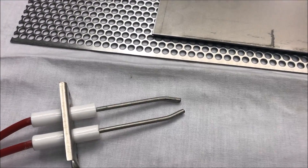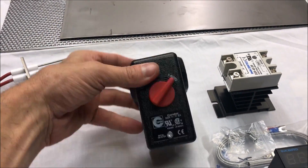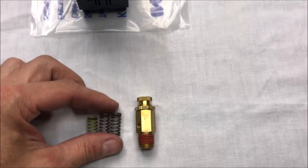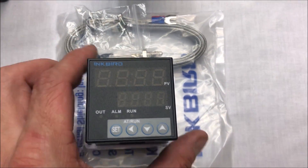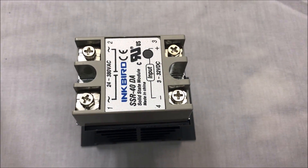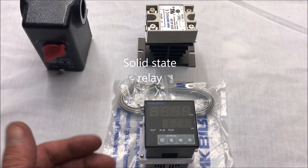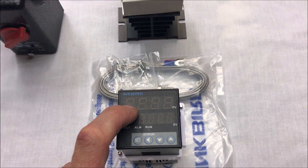We have your igniter here — a very powerful one. We have one of the pressure controllers, though I don't know if this one's going to work — it might not be high enough pressure, it's only 200 PSI. We have an adjustable pressure relief valve that came with different springs. We have an Inkbird PID controller with a thermocouple and a solid state solenoid — this will cut off the propane system when the temperature reaches a predetermined level. In the event you want to run a hot water system for killing weeds, this would be able to dial down the flame.